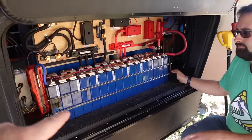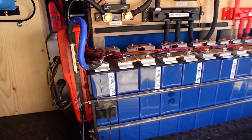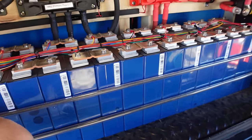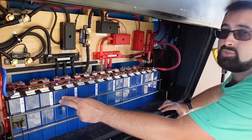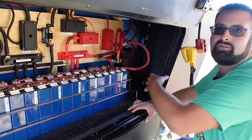Is this technically one battery? This here is technically one battery. There are 16 cells here — these are individual cells, each one is about 3.3 volts. A set of four is essentially a 12-volt battery — this 12-volt battery, this 12-volt battery, this 12-volt battery, and you're up to 48.